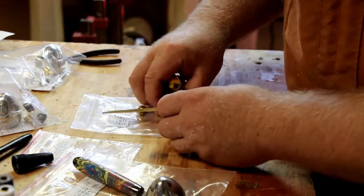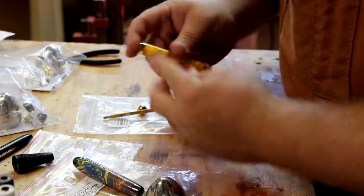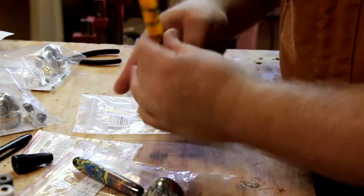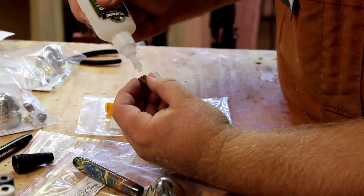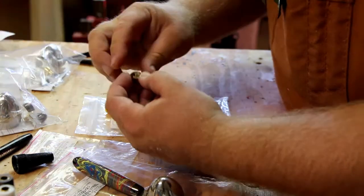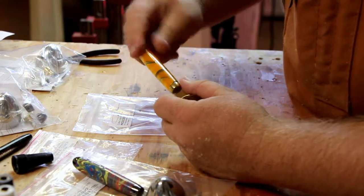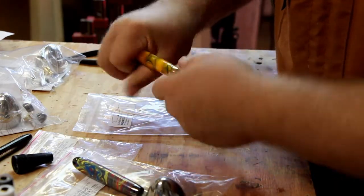The single scoop is similar, but the variation is that I had to cut this tenon on here and that will fit on that part. So I'm going to go ahead and feed this in just like before. Now this one doesn't have any threads at the front — it just slips in. And then the back end is where everything is tightened up. So I'm going to again go ahead and put a little thick CA, just a dab, and then thread this on. Luckily everything looks perfect.